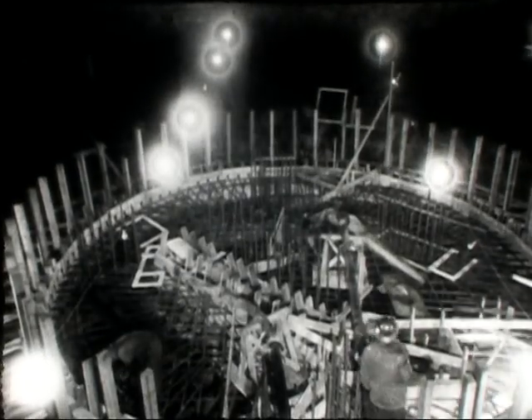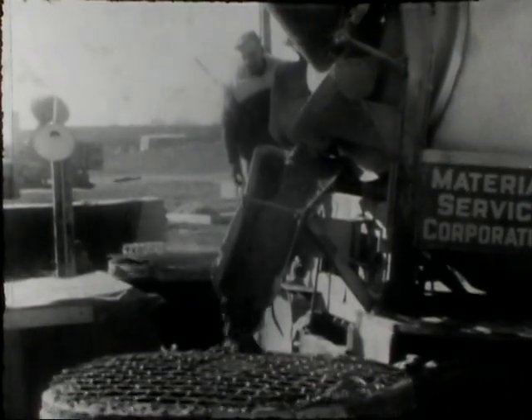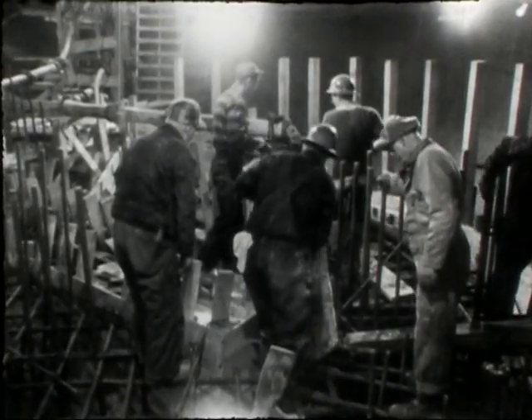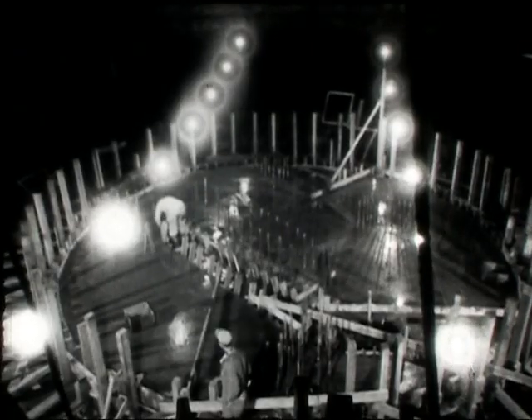The internal construction began with the laying of a bottom floor inside the shell. Tons upon tons of concrete were poured in, more than was required for strength alone. Enough weight had to be placed in to prevent the structure from being forced out of position by the buoyancy of groundwater in the event of saturating rains. Heavy reinforced concrete walls two feet thick serve as bearing walls and as retaining walls to keep the shell from being crushed by groundwater pressure. They also protect the steel shell from damage or puncture by accident or failure of equipment during construction and operation.